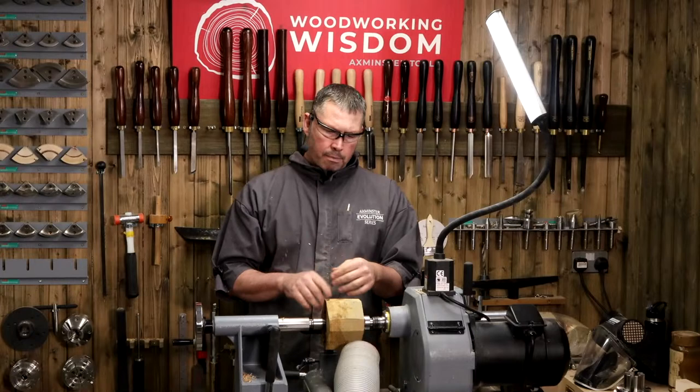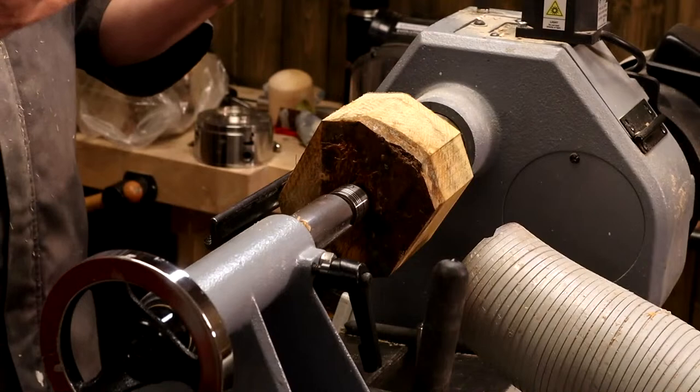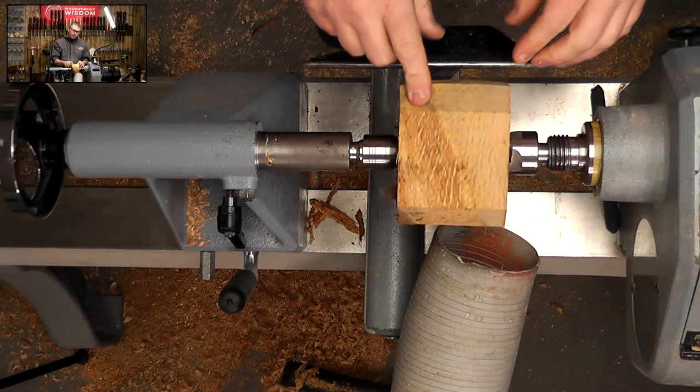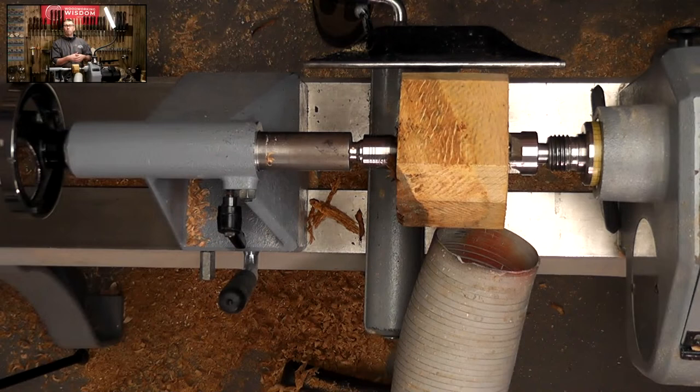It can work to your advantage if you wanted to color your timber afterwards. A solution of vinegar and wire wool brushed on would turn this black. It's a really quick way of aging oak. You'll see if you've left your timber fairly wet, your fingerprints will be there as blue marks 24 hours later. So just think about things like that.